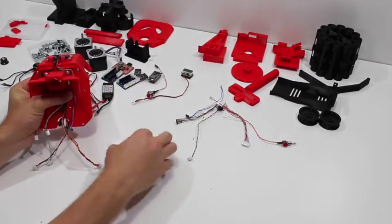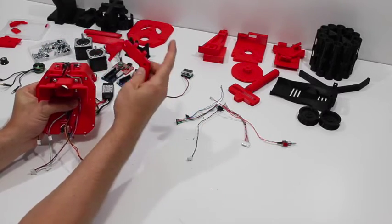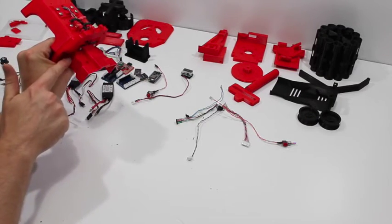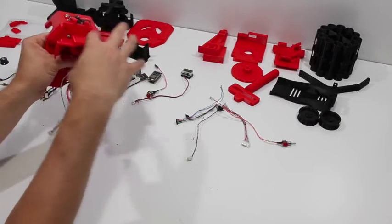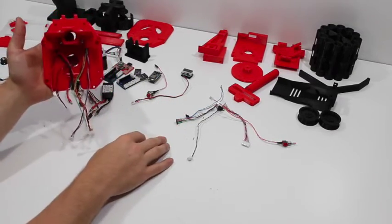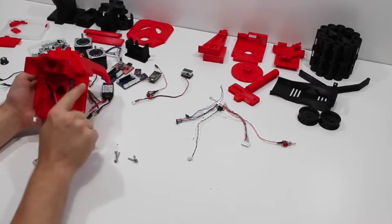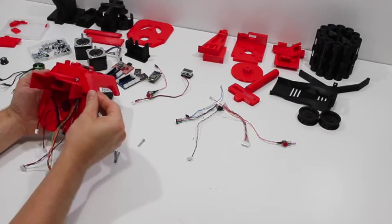Take this U-shaped piece — it will act as an electrical cap over the top of all of that. The guard from the handle will also screw into this as well. Put it over the top of the channels and as you slide it on, it will end up below the angled portion on the plunger guide. Push it all the way into place without crimping or pinching any of the wires. Everything will be securely in place. We're going to use two 1-inch machine screws and two 3/4 inch machine screws — the 3/4 inch go on the outside where there's a little depression. Start with the outsides.